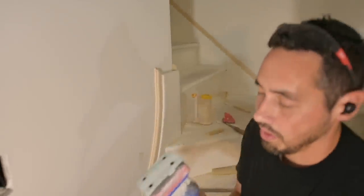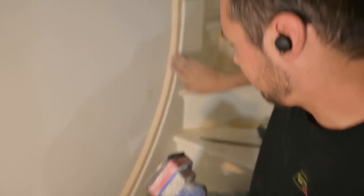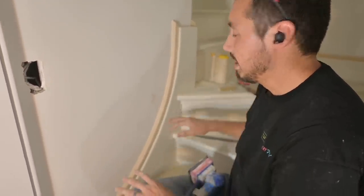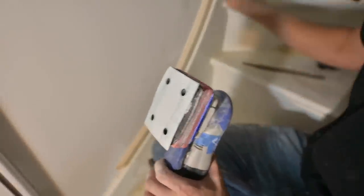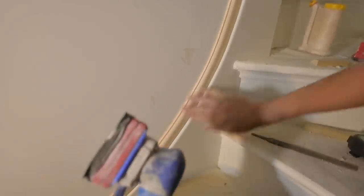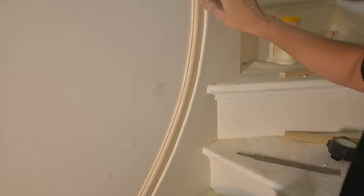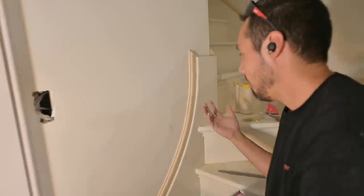I've got my surf prep sander here, which has some cushion so it can kind of hug around that profile. These were actually pretty decent as far as lining up — I tried to line them up as flush as I could on the face, but human error comes into play. They weren't perfect, but I hit them with 220-grit and knocked them down. They didn't need much. This thing is just super smooth now. This looks like a solid chunk of wood — you can barely see the lamination in it. And especially since this is going to be paint grade, you'll never know.